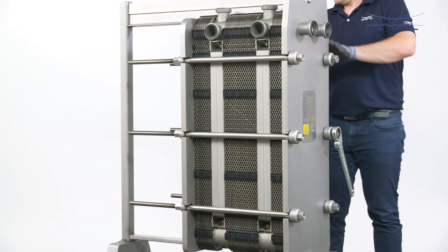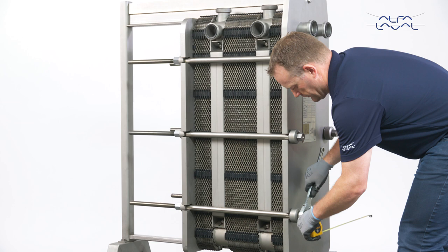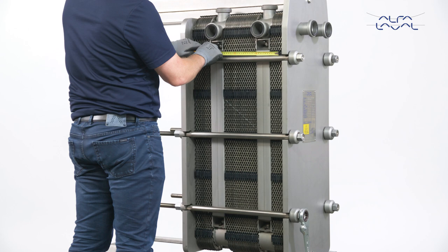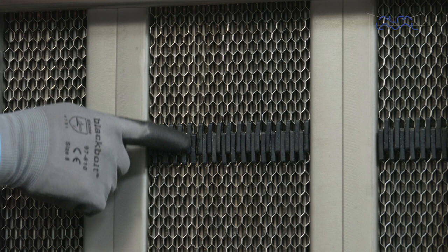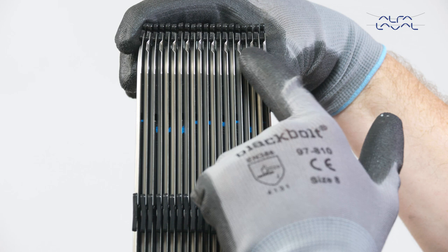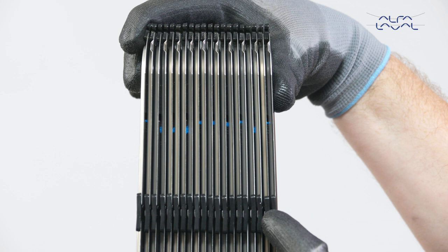The maximum amount that the unit may be tightened is equal to the A measurement minus 0.5% of the total. Over-tightening will lead to plate damage and crushing of the gaskets. If all plates are correctly mounted in the unit, the edges of the plates will form a honeycomb pattern. Also note that the gasket clips will form a zig-zag pattern. Please note that the Alfa Laval Clip 3 plates have a notch on the A side of the plate — a notch on every other plate indicates a correctly assembled plate pack. The gasket clips do not form a zig-zag pattern and there is no honeycomb pattern.